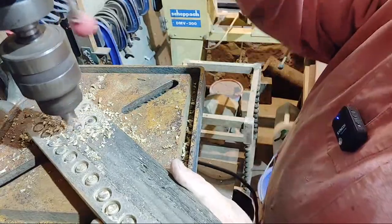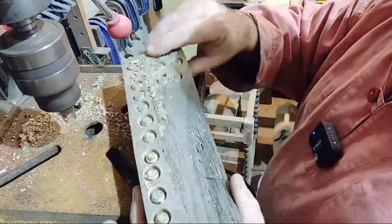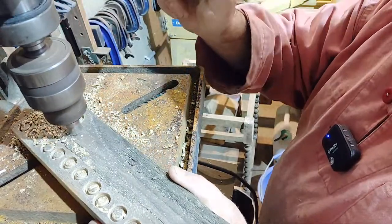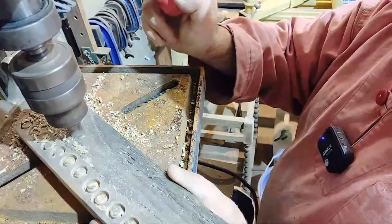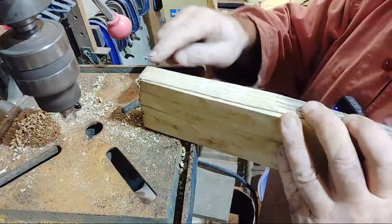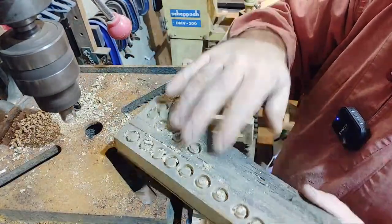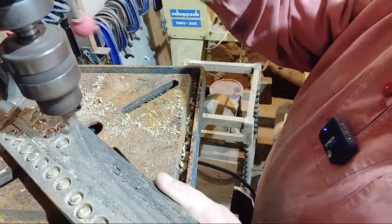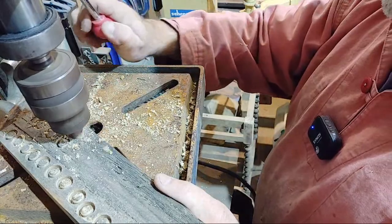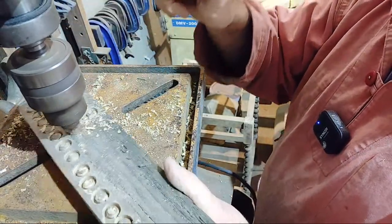You're going to think, so how do you get these plugs out then? You're going to use these little wooden plugs, how do you get them out? There's various ways you can do it. One is I could just use the bandsaw and literally cut them off. If you run it through the bandsaw this way up, cut down there, then all the plugs fall out. But the way I normally do it is literally just a screwdriver, and they just pop out with a screwdriver.